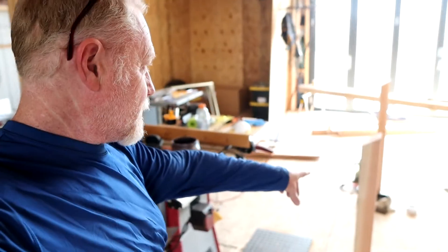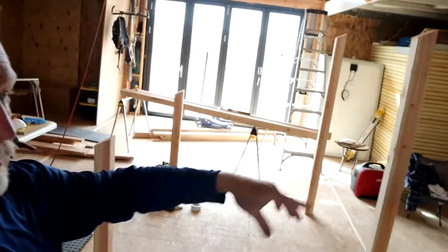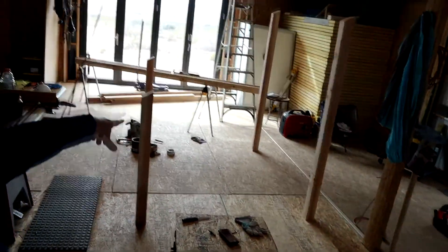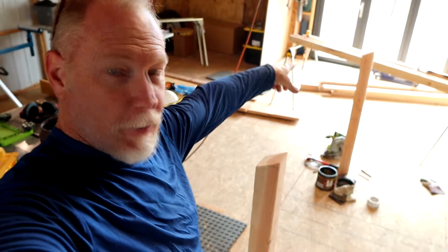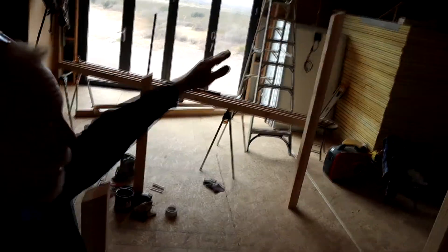I've just cut the two four-by-four ten-footers. You can see this angle of 27.5 degrees right here, and here are my two back legs. If I back up you can see the basic frame of the entire rack. Because these are at 27.5 degrees, I can just take my channel four-by-four that the solar panel sits in and rest it on top — they'll also be at 27.5 degrees. I'll rest one across the top and the solar panels should slide right in. I'm going to use clamps to mock that up now.